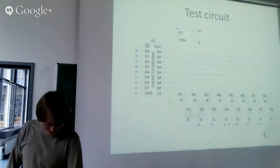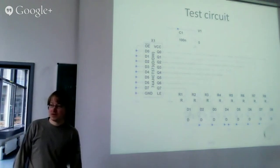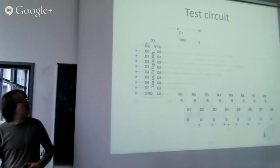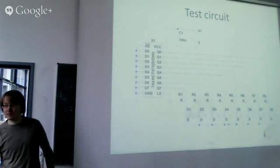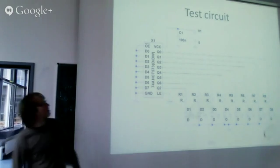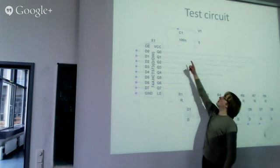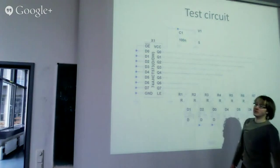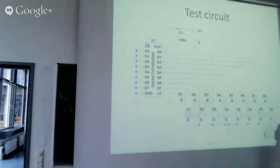Two things I know are Zener diodes, which limit the voltage level if it's getting higher than 5 volts, or your VDD 3.3 volts, clamping whatever is getting higher and maybe even destroying your parts. And the other is really having inductivities in the power supply, because that blocks all the sparks. Having inductivity in both the ground line and the plus line really helps with these mean issues. You have to do it in both plus lines, not only for the power supply, but also somewhere in the ground line.